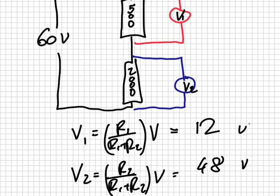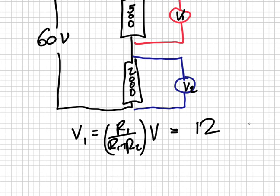2,500, 60. Did you do it the same way? Yep. So, what the heck happened? Look at the calculator. So, is there internal resistance? Yeah, there's internal resistance. Oh! Yeah. There's internal resistance as well. So this actually is different to the potential divider one. Okay. So, how much is the internal resistance? 2,000. So let me just undo those last two lines.